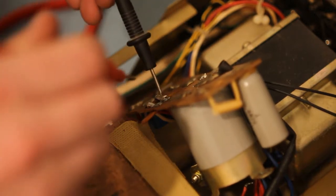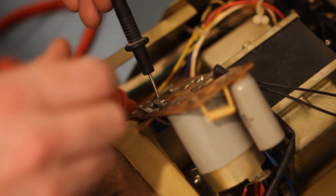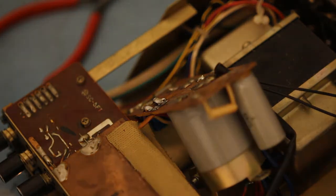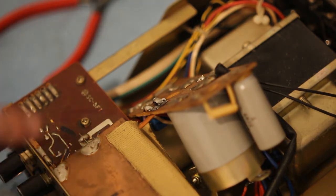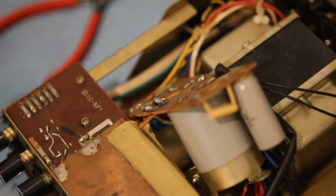Okay, so the transformer is at least not a dead short. We're getting 50-something volts DC on the AC output — seems a bit high to be honest, but that's fine. We've got a little bit of lighting on our series safety lamp, but there's a little bit of current drawn by the front panel lamp, which is about six volts or something. Transformer's good, so I'm going to put some new diodes in and re-test.